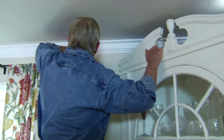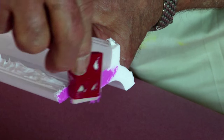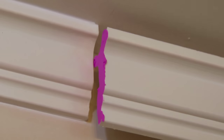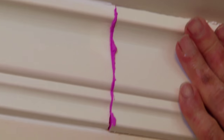Normally it would be awkward to install conventional nailed-on crown molding behind this built-in corner cabinet, but in this case it's easily slipped into place and firmly attached to the wall and ceiling in a matter of seconds. Applying spackle to the ends of the butt joints before installation ensures a strong bond front to back that will prevent the joint from moving as the two pieces of molding are pressed together. Excess spackle squeezes out the front.